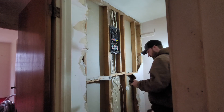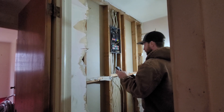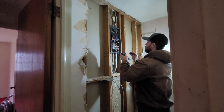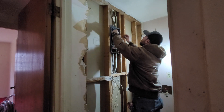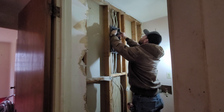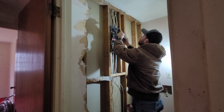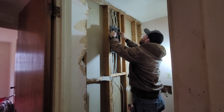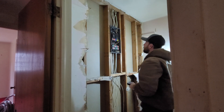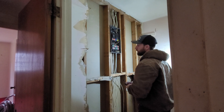I know there's no power on the house, but we're just going to check this with a multimeter to be extra sure. We shouldn't have any volts coming through. Yep — one leg to ground: zero. The other leg to ground: zero. And both legs together: nothing. So we're good — no power, no loads on anything.